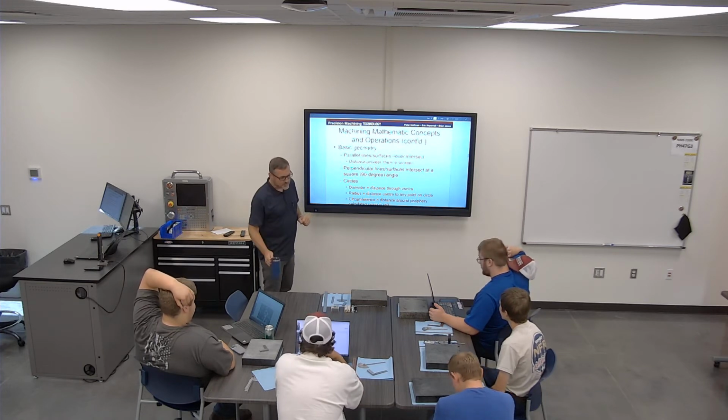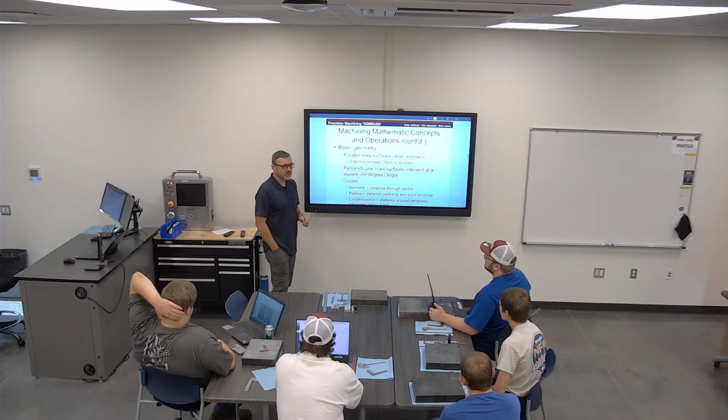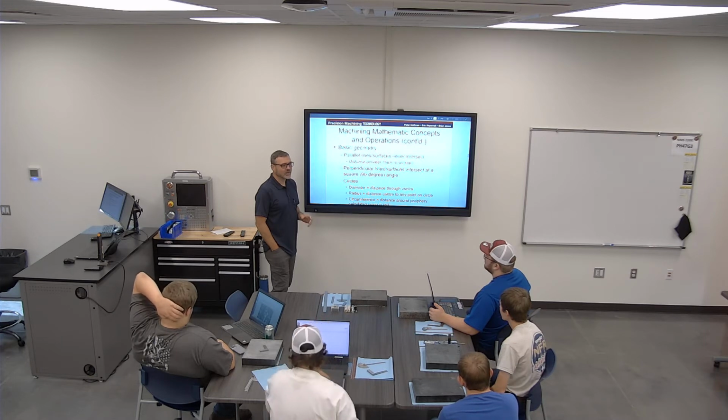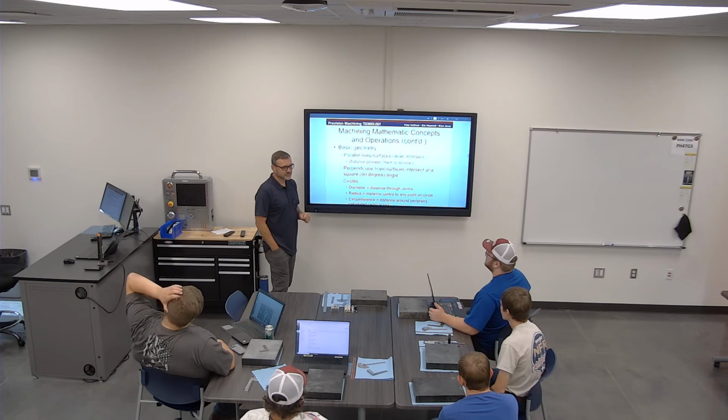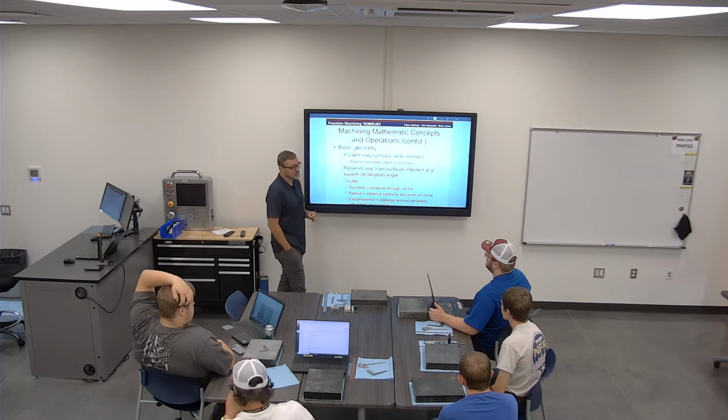And that's pretty thick. Really? 5 and 5? Yeah. That's a pretty solid ratio. We're going to do like 2 and 5. We're going to do like 1 gallon to 7 gallons. Well, it depends on how much you need to fill it though. Yeah, 1 gallon of coolant to about 7 gallons of water. I mean, that's pretty standard.